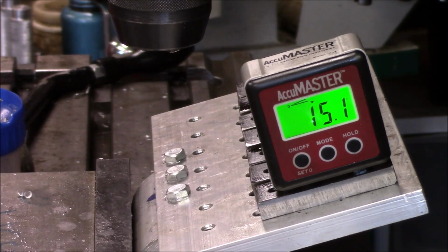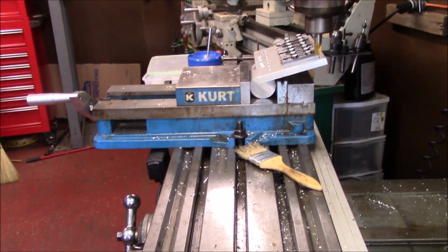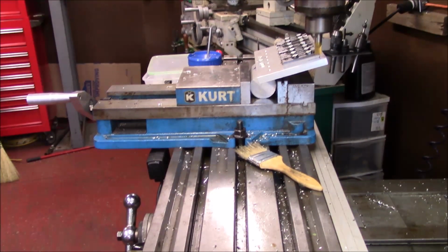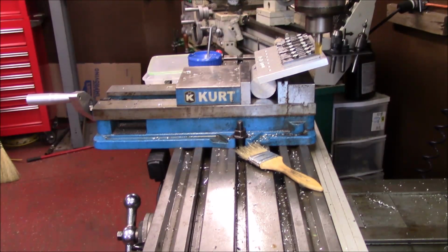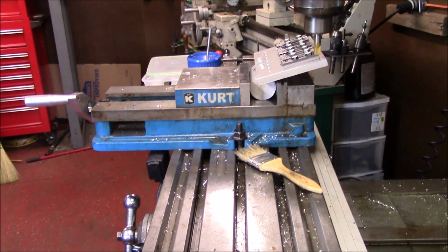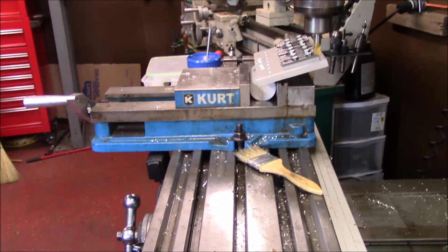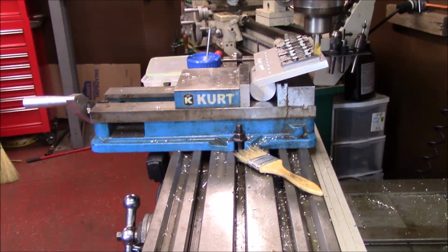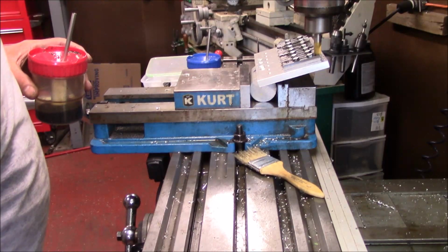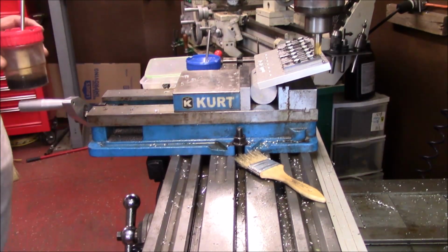So I've got to find the milling cutter I want. So I'll be right back. Let's see what happens. Let's turn the feed down just a little bit. Put this thing in. And let's see what happens. That's a Niagara carbide cutter I'm running across there. And we might can stand to give it a little more than that. That's a 50 thousandths depth of cut.